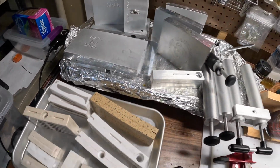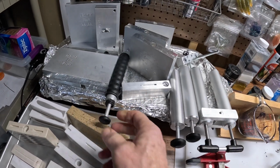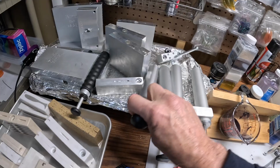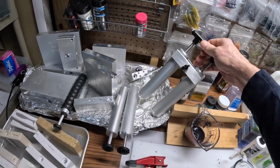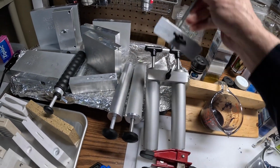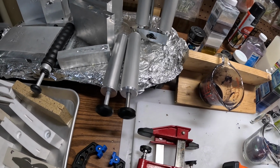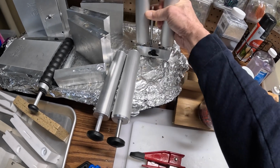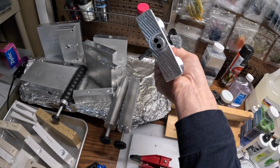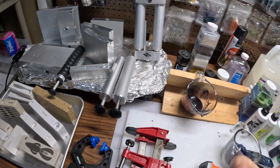So a little bit about molds, injectors. This is another 1.5 ounce, like the one I'm giving away. These are bigger. These are 4-ounce molds. And then this one is a dual injector that allows you to do 2 different colors of plastic with a blending block. So you suck up the plastic out of 2 different cups, pop it in here. Kind of tough to do one-handed. And then when you inject, it will inject 2 different colors. You need a certain type of mold for that. It has to be one with a top and a bottom, not a side-by-side one.